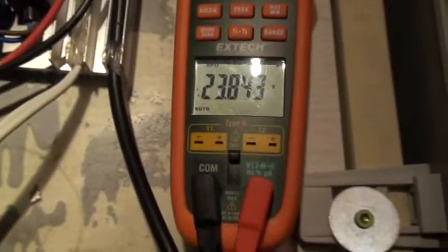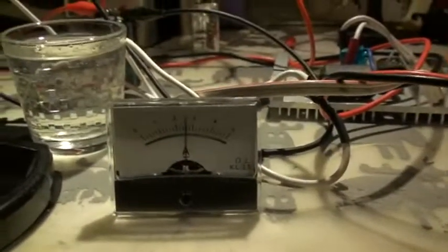The idea is to put this vapor into a motor carburetor to try it out. I now have 24 volts here, with a smoothing capacitor — so it is really 24 volts RMS. My system here is a True RMS, so it gives a really accurate reading: approximately 24 volts RMS. As you can see, it is smoothed with this capacitor. The amp reading is 2.5 amps, so about 60 watts — 60 watts to get this steam, and to maintain boiling water at 98 degrees for more than 30 minutes. So I can accept this measurement. We can get this vapor with 60 watts, and probably more if we look further.